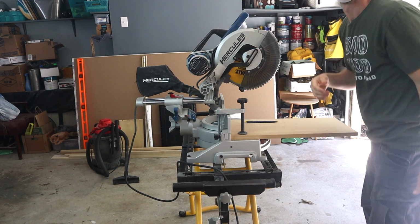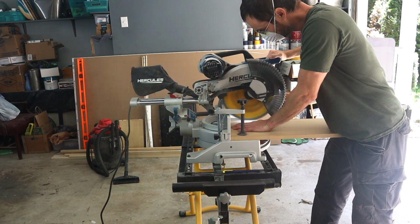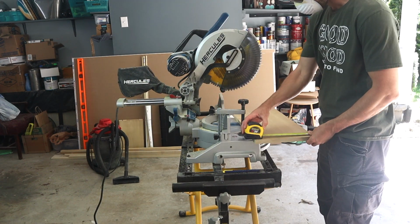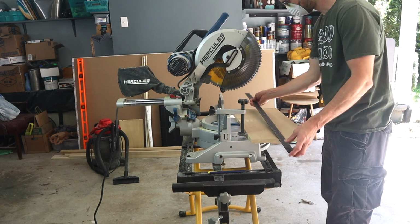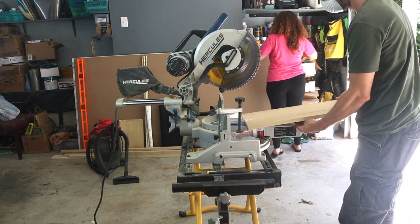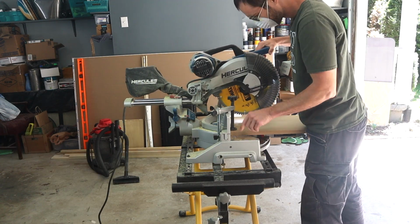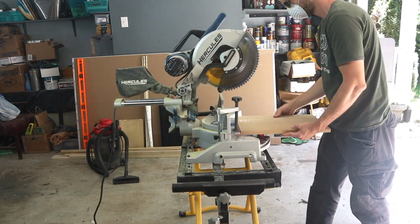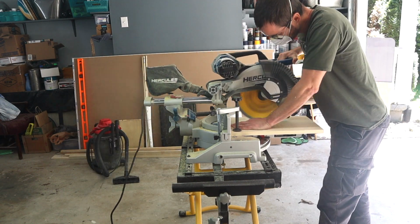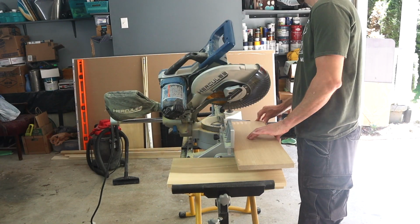Once you have your safety net established, you go ahead and start by making your walls, 2 walls, and the back piece. You'll see that Daniel uses multiple passes on the miter saw, and that's to avoid tear out in the wood. We're using poplar for the sides. It makes a nice paintable hardwood, and we have plenty of it spare from other projects.